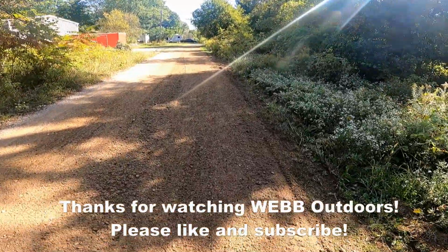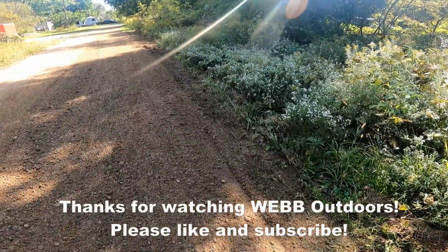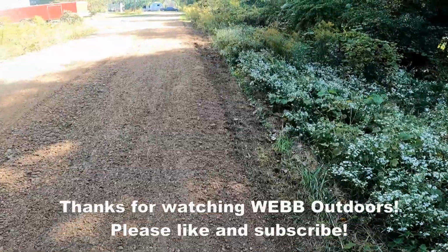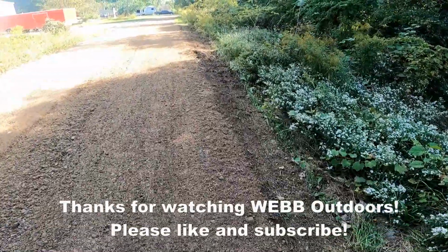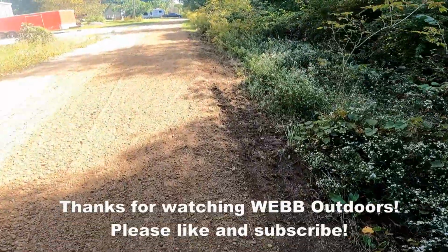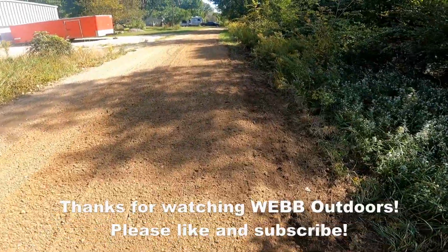Looks really good. What I did along the ditch line is I ran my box blade about half off of there and dug up the ditch a little bit. I've got a nice finished product, so now the water will run off the side hopefully and get rid of the potholes. We have a nice smooth road now, and thanks for watching.